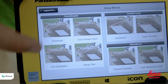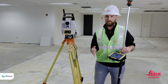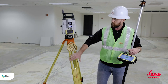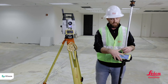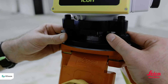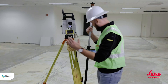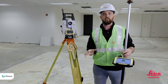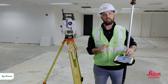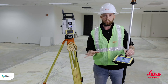For this one I'm going to show you how to set up using coordinates anywhere. When you go through this it's automatically going to bring you into your leveling screen. To make it a little easier, line up your face plate over one of your tripod legs — that way you know the directions on your screen are accurate. Get all three green check marks. If you can't quite get there because the floor is bouncing or you're up on a deck, get it as close to center as you can. As long as that bubble is inside the inner circle you're good to go — the tool can compensate for it.